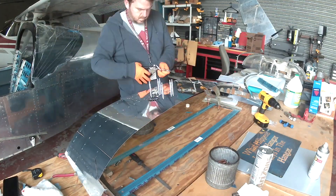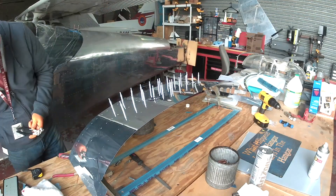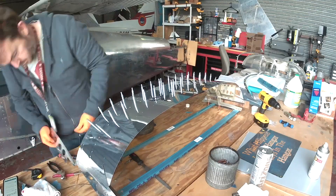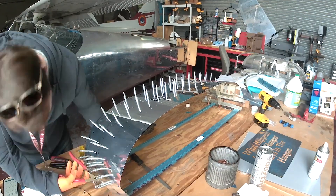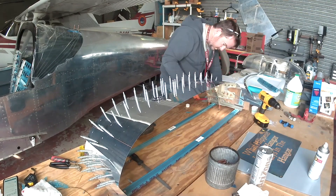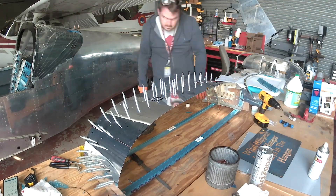Here you see me shaping down the flange edges. You know how a couple years ago we were doing the ribs for things like the vertical stabilizer — wherever there are ribs and flanges you had to shave them down so as not to create little bubbles in the skin. That's what this is. Along both of those hard connected internal ribs, you've got to shave it. Anyway, next video we'll continue working on this, so see you soon.